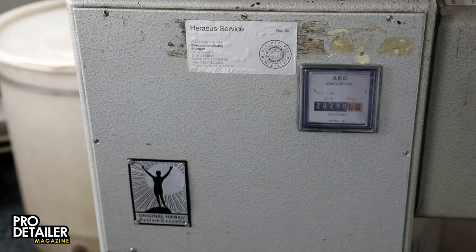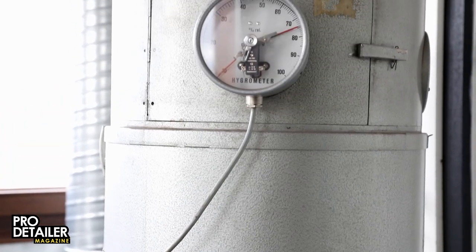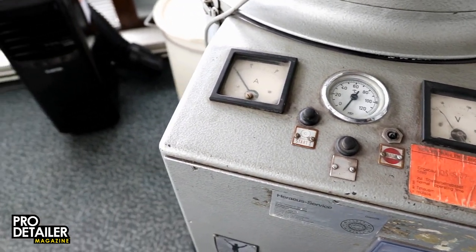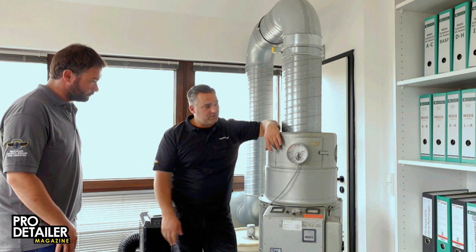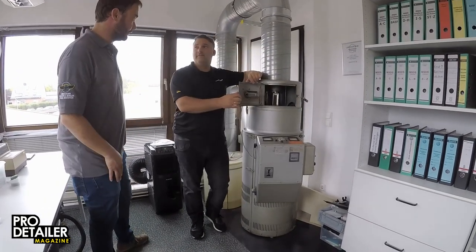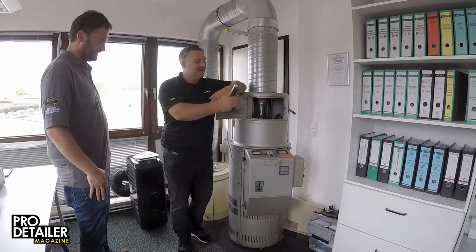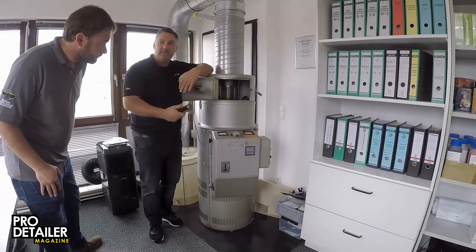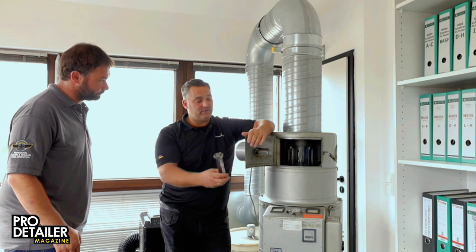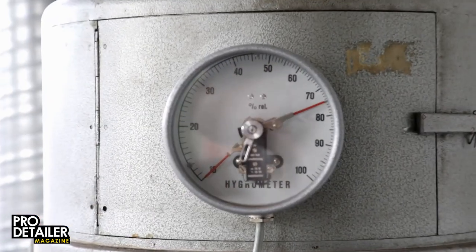Actually this is a Xenon Tester WL. It's an old machine so the new one looks much more fancy, but it still works. We are proud that we have this kind of machine because all these testing machines are really lab machines, certified, so they're very expensive. What you can do is light testing — there's a very very bright light inside. You can see here the testing patch of leather, which is covered up so it doesn't need any light. And you can make it very dry inside or you can make it wet inside — we have water here. Then you can figure out what's happened with the leather in the next few years.